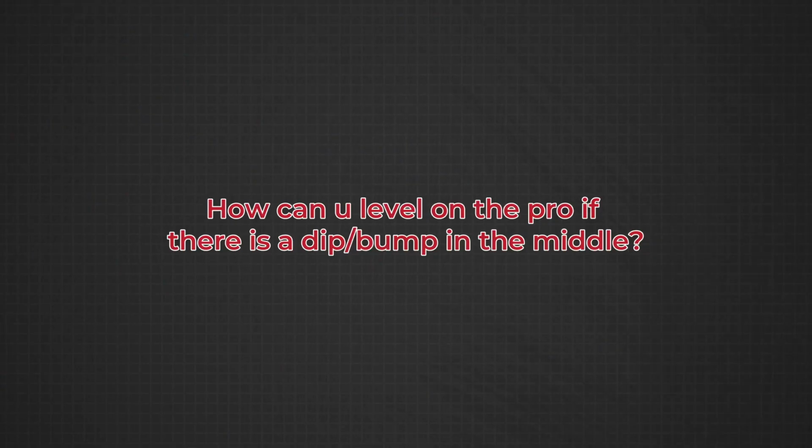So if you're really trying to go for a really flat surface on that, using those adhesives, smoothing them out beforehand, I'll actually use another tool over it. That can help get a good surface for polypropylene. Those are really, really particular. And then adjusting the Z offset to make sure that you're pressing it down a little bit more than you can typically go without a raft. It's going to be the same process.